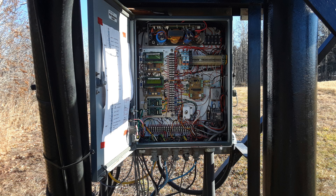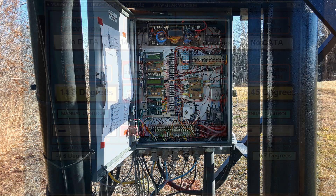Other lines going into these two control boards are the end-stop switches to prevent the dish from traveling too far. There is one more PIC board in there which takes all the various voltages for different circuits, the motor currents, temperatures from inside and outside the enclosure, and converts them to serial data to be fed back to the shack for the data screen on the Visual Basic program.